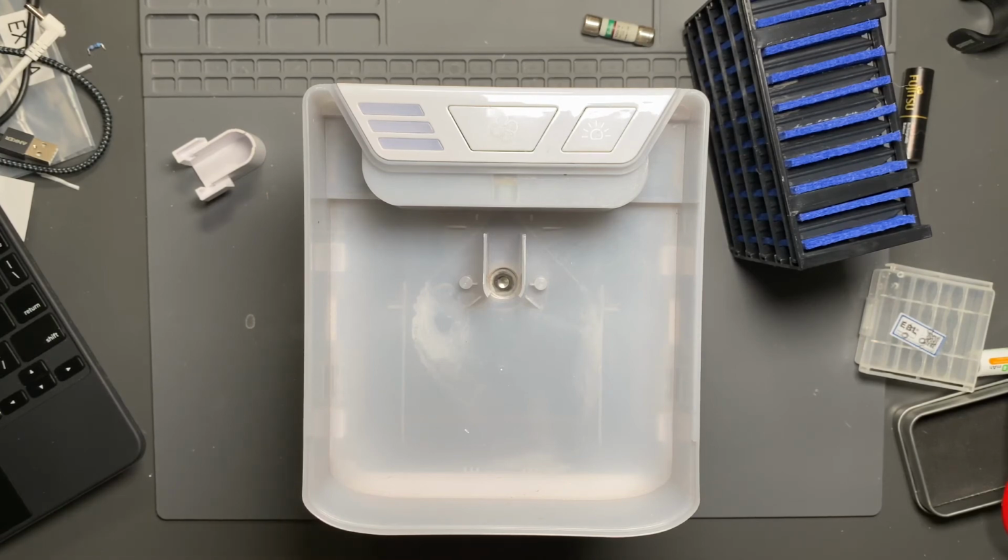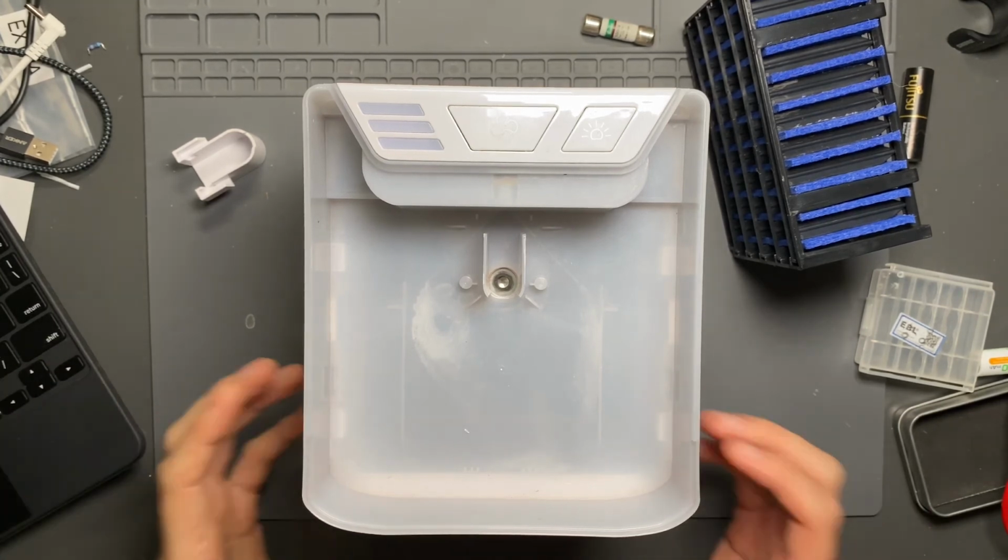The other option is capillary action, which is used by Evapolar and the cheap ones that mimic Evapolar, it seems. They just have treated paper in there that works like a humidifier does, where you have a wicking filter that sits inside of a pool of water and wicks up using capillary action. I would avoid those systems.